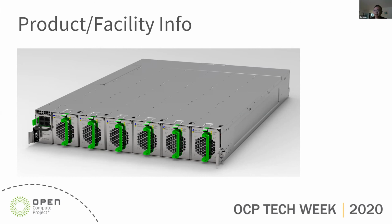So we have 6P, so 5 amps is about 5 divided by 6. Let me calculate. Each cell is about 0.8 amps, so it's about 0.5 C. So 5 amps is like half a C. Okay, that's good actually.